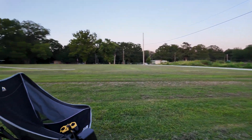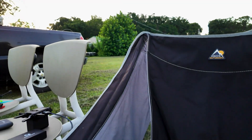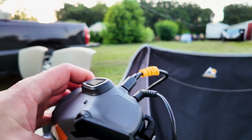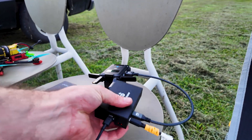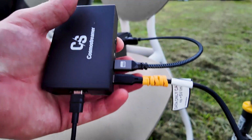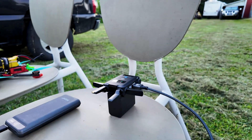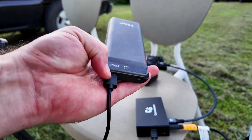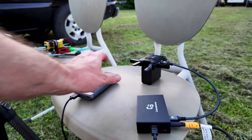So what we're doing here is we have — crazy camera — from the goggle, USB. USB runs into Cosmo Streamer. HDMI out into the SDR. DJI transmitter. This is the battery pack for the streamer. It needs 5-volt USB-A. Only A — C does not work. No C cable works. It has to be A.